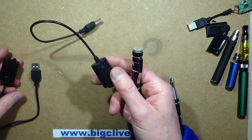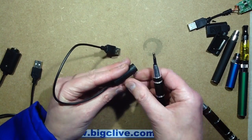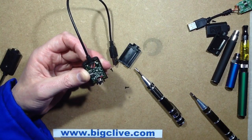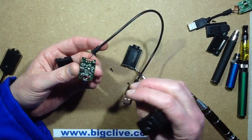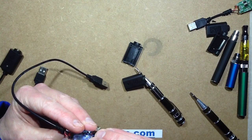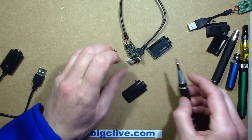Let's open the next one. This one does have a chip on it — I'll take a look under the microscope. But even before I look, I can see once again it's just positive and negative, no data, so it can't communicate with the computer. The chip is marked SL1053, a very common charging control chip designed for charging lithium cells. Nothing major there, particularly given it's just got two wires. So that one's safe too.